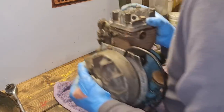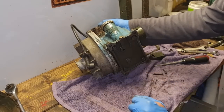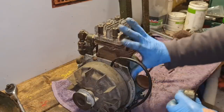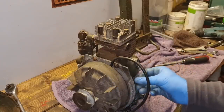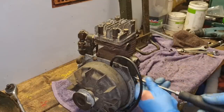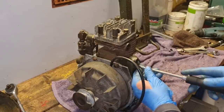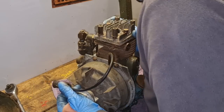How does the sump come off this? The sump comes off so we can naturally take our piston out, which is good. Someone told me: when you take a screw out, put the bugger back so you don't forget where it goes or lose it. So we'll temporarily put those back. Then we'll buzz that sump off, take that head off, and see if we can get that piston out of there. I don't want to damage this HT lead.